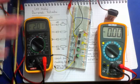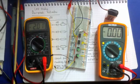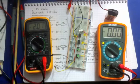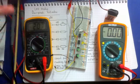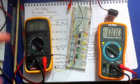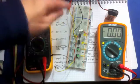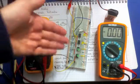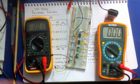So you've got quite a coarse resolution, only 2 volts between each LED, but it's quite good for things like MP3 players, which often run about 5 volts, 5.5 volts. So quite good for that. There's also quite a number of devices that are 3-volt devices, so you can check it for that. And like I say, if you wanted a finer resolution, you would just build a similar circuit to this, but with more op amps included. You double the amount, and you get half the resolution again, a finer resolution. So that's basically how it works, and that's the bar graph voltmeter.